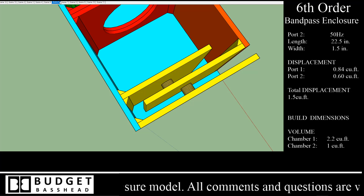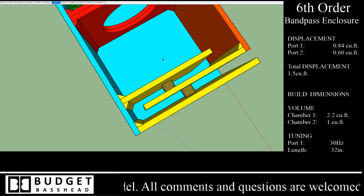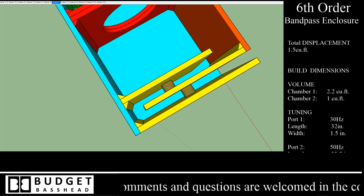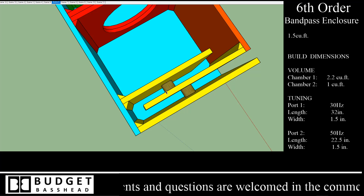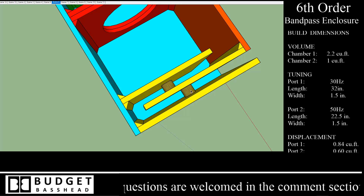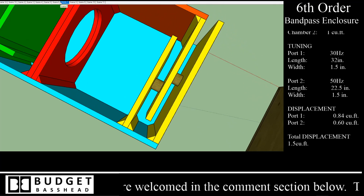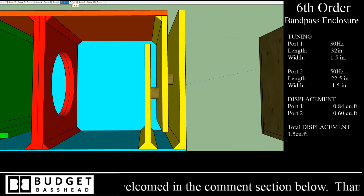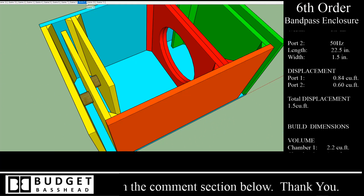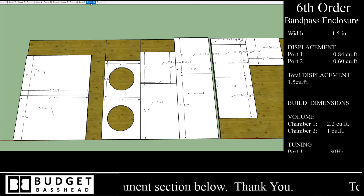You really want your baffle to be as strong as possible when building these types of enclosures, because it's going to have to restrain all of the force directly exerted upon it. In this case my subwoofer is nearly 50 pounds, so you want your baffle to be pretty strong. The 30 hertz port is represented by yellow and it has two of those dowel bracings — approximately one and a half to two inches wide. You brace each one of these because this thing is going to be pumping a whole lot of air through there and you don't want your ports to flex.